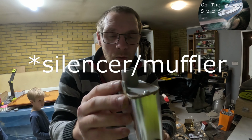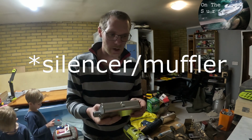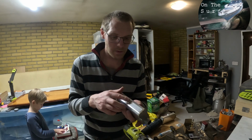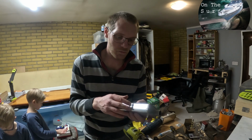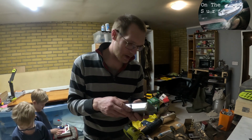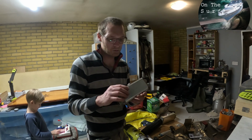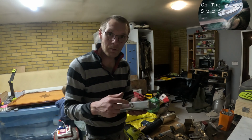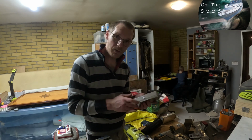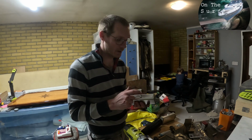Yep, so there it is. One heater sealed up and ready for use inside. And yeah, you can use a rivet or whatever metal you like. I like threads and I like M6, it's the standard size, and I have the taps and everything, so that's why I threaded and put a bolt in, and I don't have a rivet gun, so both work. If I had a rivet gun, I would have put rivets in instead.